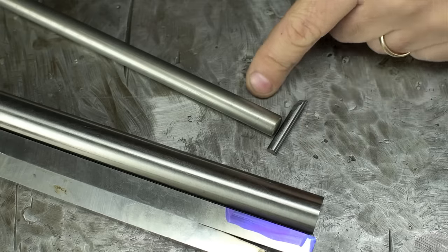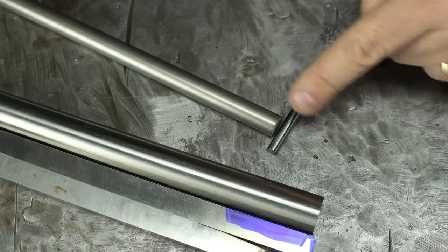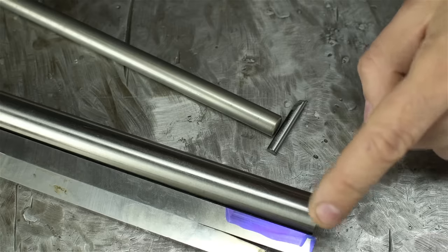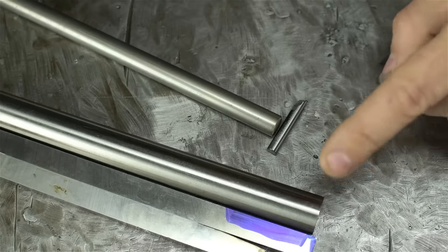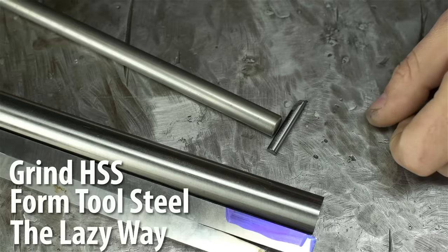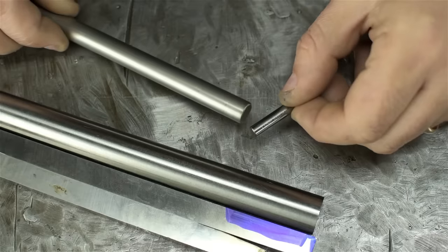This is just a piece of 3/8 cold rolled — might actually be stainless by the looks of it — and this is a broken end mill. If we could attach these two, we're 90% of the way there. I don't personally feel like grinding away a ton of high-speed steel or going through a hardening process, but the choice is yours. A built-up tool it is.